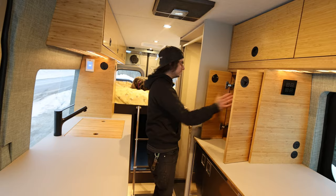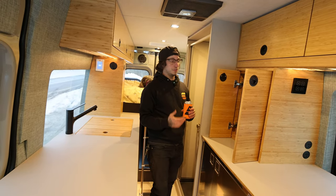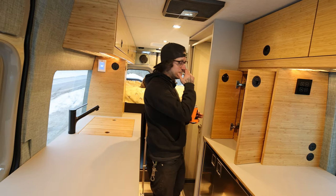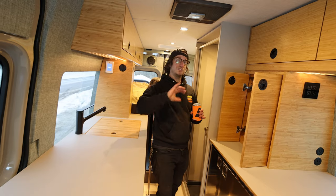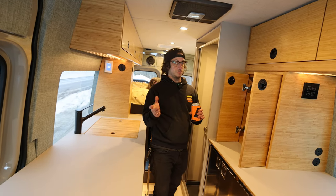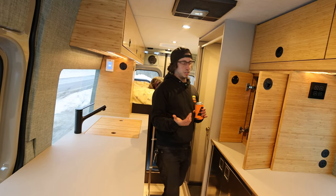I keep the circuit breaker panel right here instead of in a box because I use my breakers — they double as switches for the ball valves, lights, anything. For a circuit breaker it's prudent to exercise them; you don't want the contacts to sit in one position for very long. So you're actually increasing the lifespan of a breaker by making it a switch.